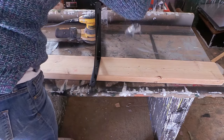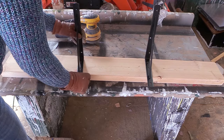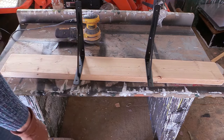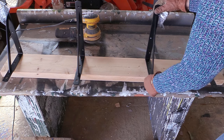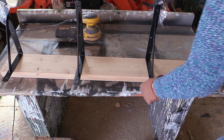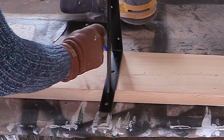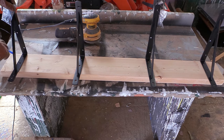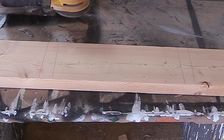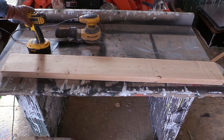Then I measured off where I wanted to put the bracket hangers. These are basically L-shaped brackets that I bought at Walmart for around five dollars a piece, and they even included the hardware. I took the L-brackets and spaced them out where I wanted them permanently on the board. After deciding where they would go, I took a pen and traced where each bracket would sit. I'd highly encourage you to mark off with a pen or pencil where the brackets are going to go.